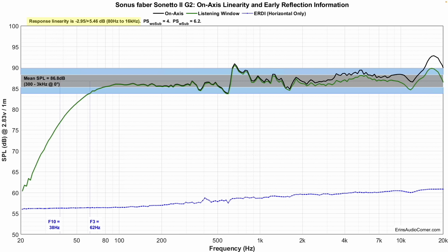Sensitivity is about 86.8 dB. Around 700 Hz, you've got a resonance, and the treble region is boosted by about one and a half to two decibels at certain areas. What I heard was some of the boosted treble, but mostly what I heard was in this region — the sound that tends to be more forward, around 1 to 2 kHz. Hollow and nasally are the words I would use subjectively to ascribe to what we see in the measurements.